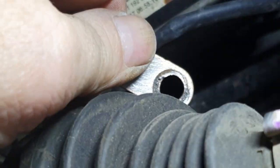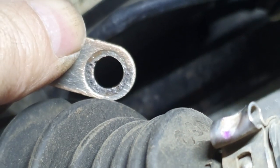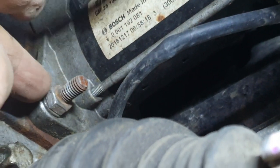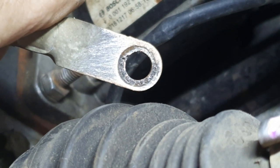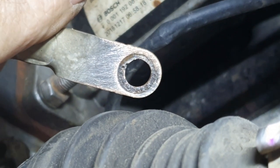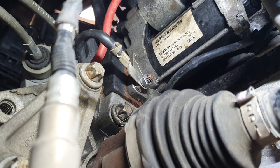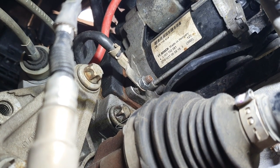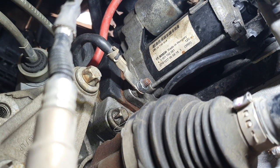We've got it all cleaned up on both sides as best as I can — it's quite pitted so I'll have another go at it. We'll also take this bolt out and give it a clean-up on the wire wheel. It's quite pitted so I need to attack that a little bit further — let's get a file on it. It's all cleaned up, I've got a new nut on there. Yes I know it should have a spring washer but we haven't got one — it's very tight, I might even double lock-nut it. Let's get the rest of it built up and give it a test.